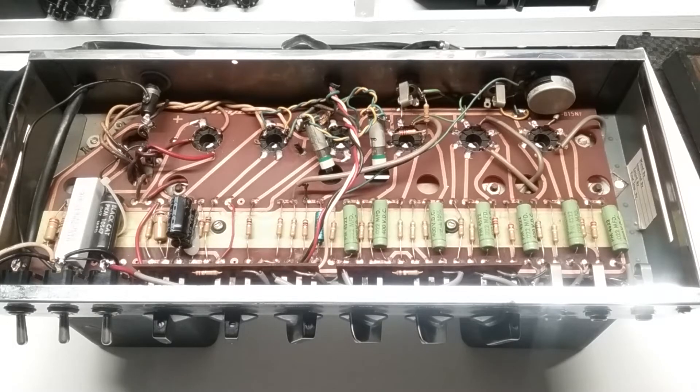I'm not a bass player, so to each his own as to what sound a person wants to squeeze out of their amp. However, the customer did mention some muddier sonic characteristics when hitting certain notes that he really didn't like. There may be other reasons for that, but I want to get the rectifier back to factory, which has a negligible voltage drop or sag in comparison to the 5U4GB. We'll tighten up the sag in the rectifier and work our way down the line getting all the other component values brought back into spec.